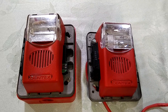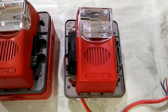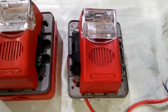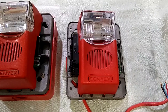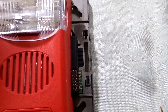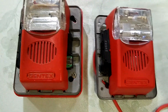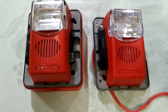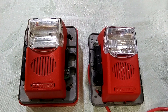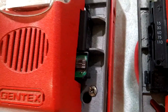These horn strobes can be configured both for 2-wire and 4-wire operation. When I got this GEC3, it was configured for 4-wire, so I decided to, for ease of use, switch it to 2-wire by flipping these first two dip switches right here into the up position for on, same as over here. Now the other four dip switches control the horn. You can see the dip switch on the Commander 3 is quite a bit bigger and easier to use than the one on the Commander 2.